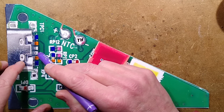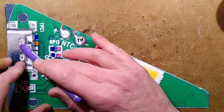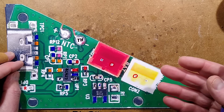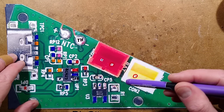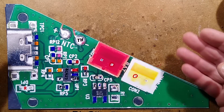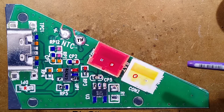There are no identification resistors in this. Usually there are two resistors — it wouldn't have added much to the cost at all — but they didn't add them, so it's a dumb USB connection point. If you plug this into smart devices, they may not even acknowledge it and won't start charging it. If it refuses to charge off your favourite USB power supply, just use an old dumb charger and it will charge, usually.